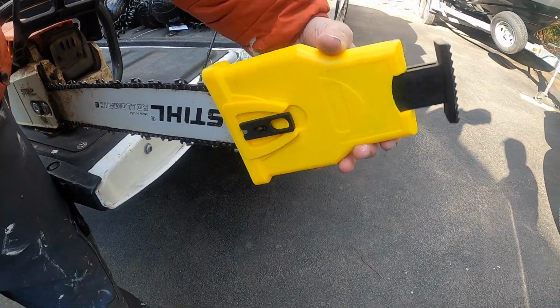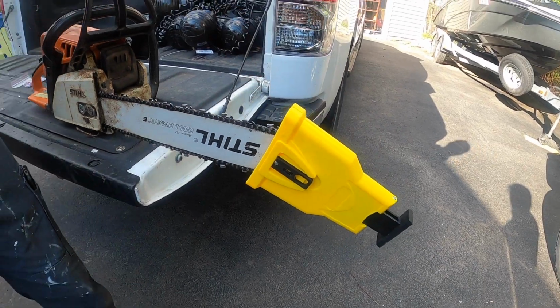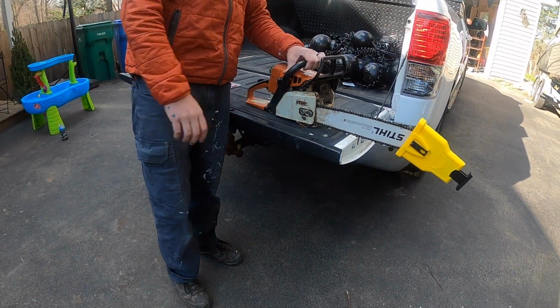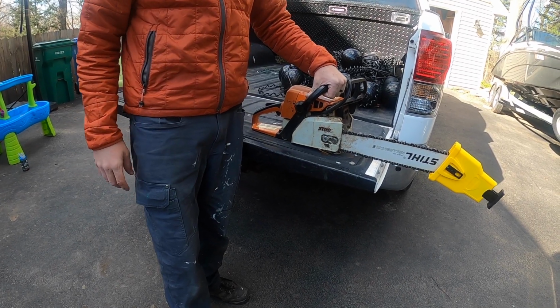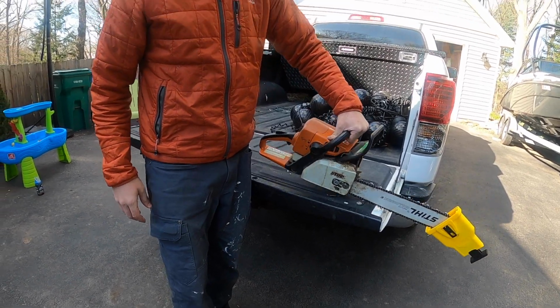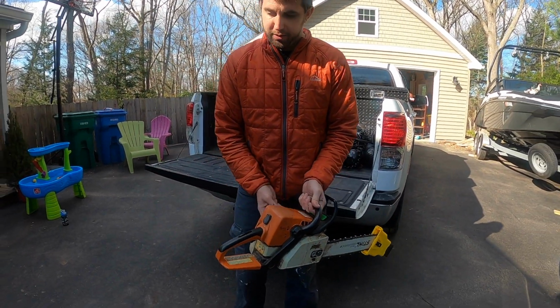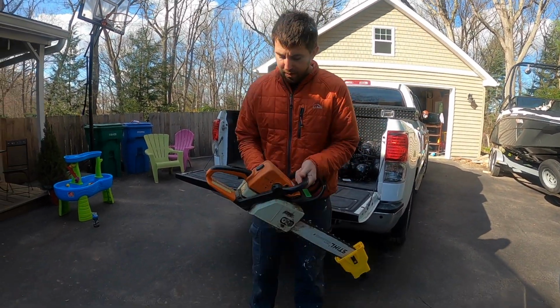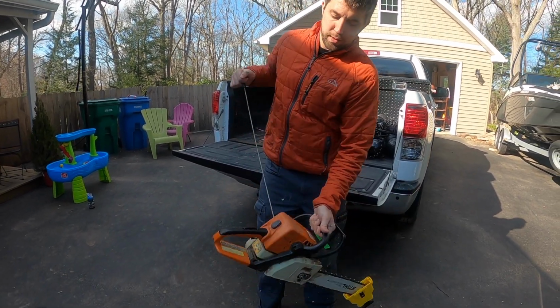So you'll see, because there's only 1 hole on here, this is your problem with the Stihl. So when you start it, I'm going to actually push the stop bar down to prevent the chain from going. Once I get it straight against the surface, then I'll engage the chain. Rule of thumb on a Stihl, guys, 3 pulls max, or you're going to flood it. So you go to start, you go to half choke.